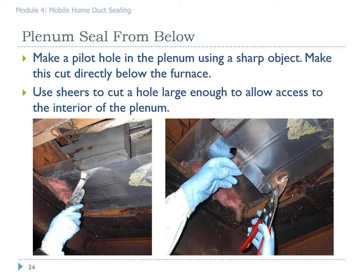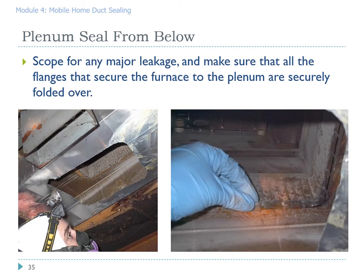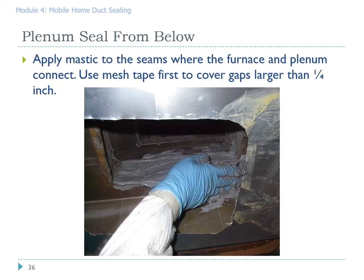Next, get your shears or snips out to cut a hole large enough to allow access into the interior of the plenum. Before doing this, make sure you lock out and tag out the electric breakers that serve the furnace. Once you have access, fold over the tabs from the original furnace to plenum connector that were never folded over. Before putting your hands into that hole, it is best practice to put duct tape around the edges — overlap them so there are no sharp edges before sticking your arm in. Cover any big gaps with small pieces of sheet metal or self-adhesive sheetrock tape and apply lots of mastic. You've made the hole — there's no excuse not to get everything you can reach.